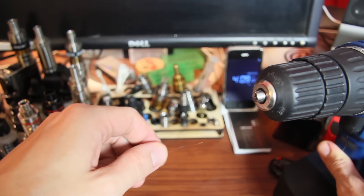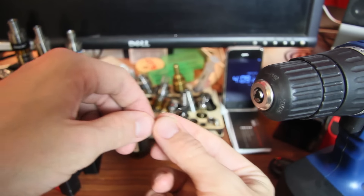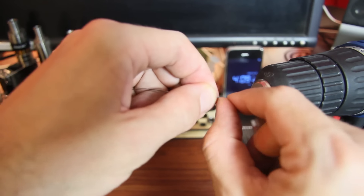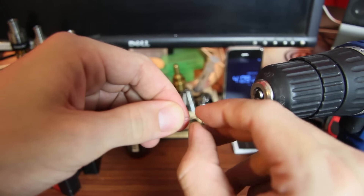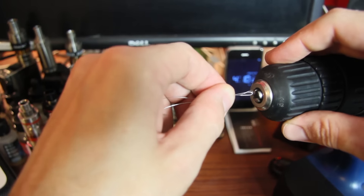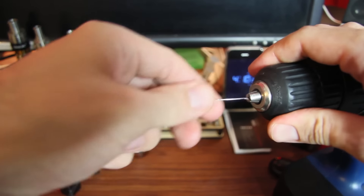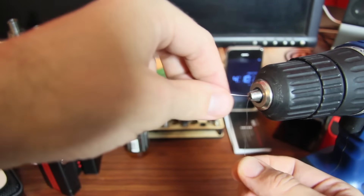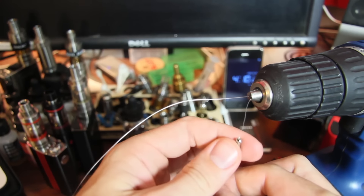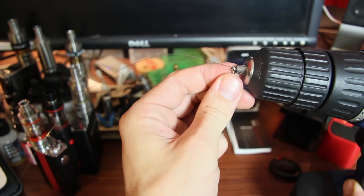Now it's time to get both of these into the drill. Let's open up the chuck and get one end of our straightened-as-much-as-possible 26 gauge inner core. Run these together like this — what I do is just simply put a bend in them so they're together, and even bend them back up. You want to insert them so that the leads coming out are as centered as possible — that's very important, that's most of the equation here. Then tighten the chuck. Take your little pro-tank pin — and again, if you don't have one this is just a trick, you can use your fingers.